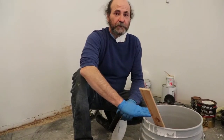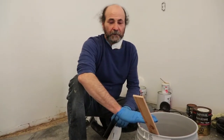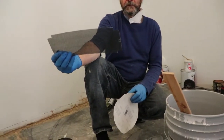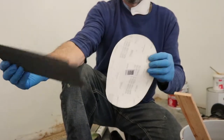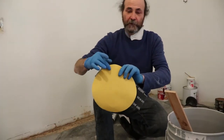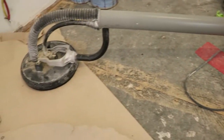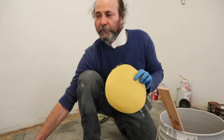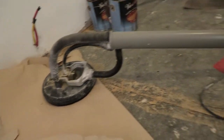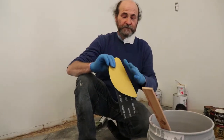We're going to do one coat and then wait about three hours, then we're going to sand it. We'll use 150 grit. I'll probably end up using this orbital sander — it's a good sander with good head movement, as you can see. It can also connect to a vacuum, so it's probably what I'm going to use, and it's faster too.